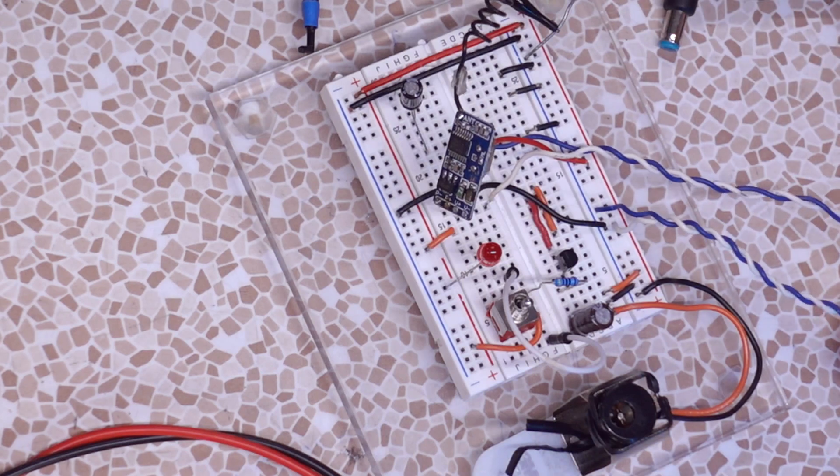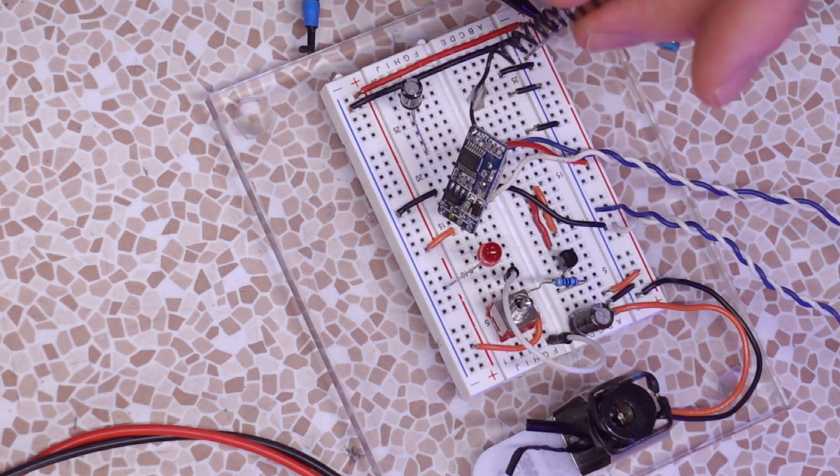Sometimes you sit down on that chair there and you want to turn it on and off remotely. Now I bought this little device here many years ago for one of the last iterations of my living room PC. I've got these cables rigged up here — they're kind of like the motherboard jumpers. They're on some specific spots on the motherboard to tap into power and button signal. And then I just have this little module.